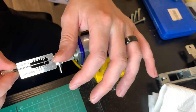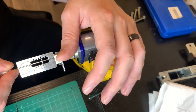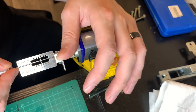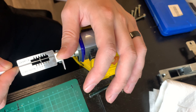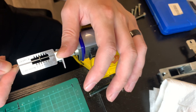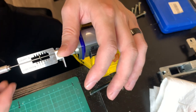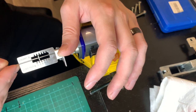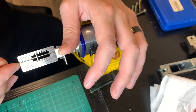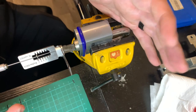He's binding all the way down but I'm not getting a click. We've got a click that time — I put a little bit more tension on. Four is binding us. Click out of four. Three is binding us, and I'm just walking my way up on top of the pin as I'm pushing down. Deep one — I had to twist it quite far, so that'll be a shallow cut on the key. Two is binding — we're going in order here. Walk my way up on top of that pin. Click out of two, and one is binding. Walk our way up onto one. No anti-pick this time.